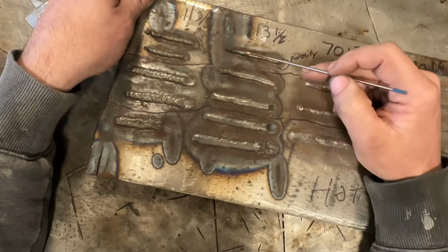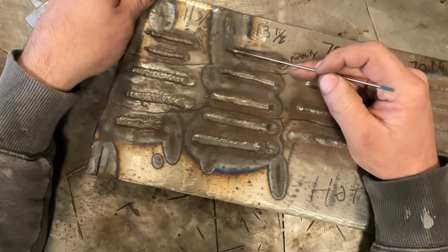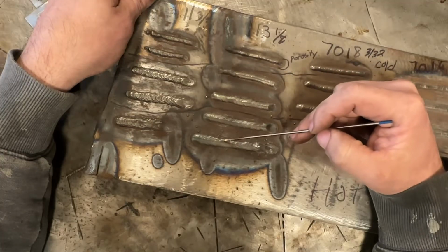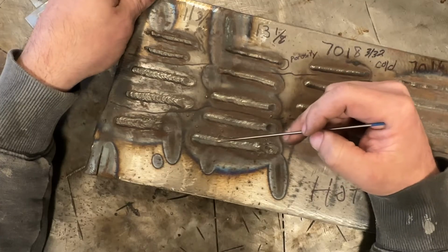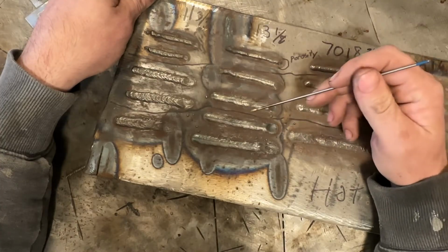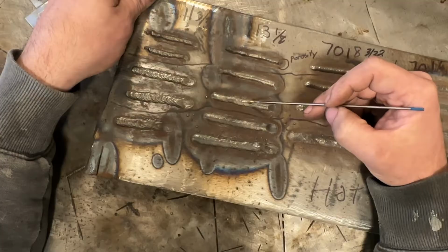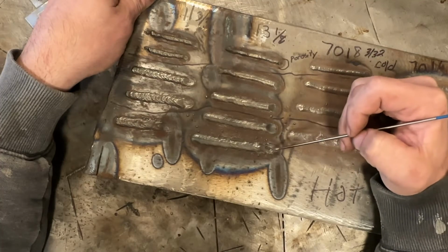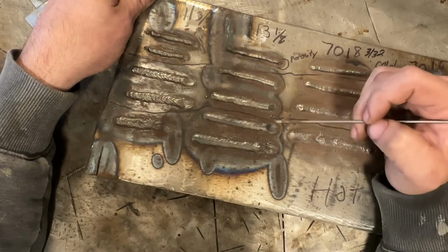So it's not like to produce a smaller weld, I really move super fast forward, and then to produce this wider weld, I moved really slow. These especially in here were run all at the same. So by increasing heat input, I flattened the bead and widened it. It also, to a certain extent, improved the penetration, but there are limits on that.